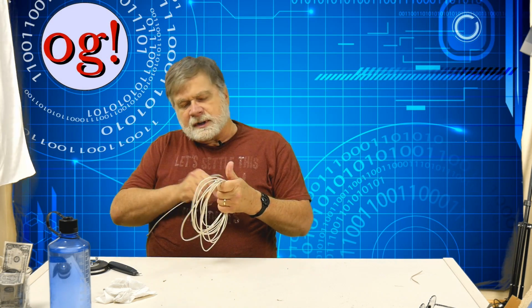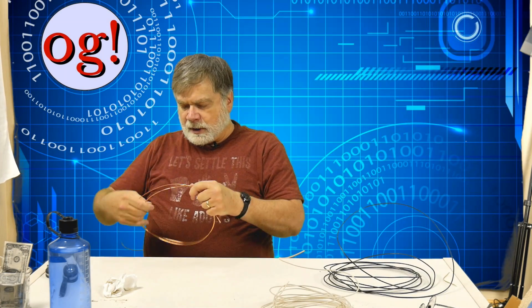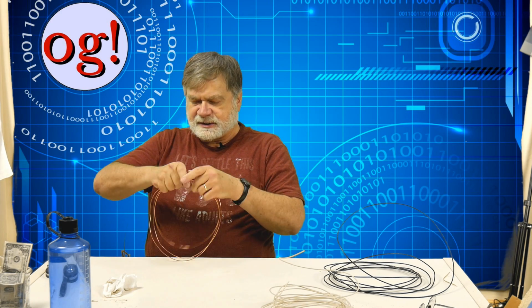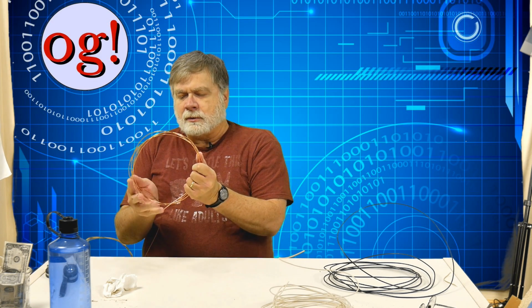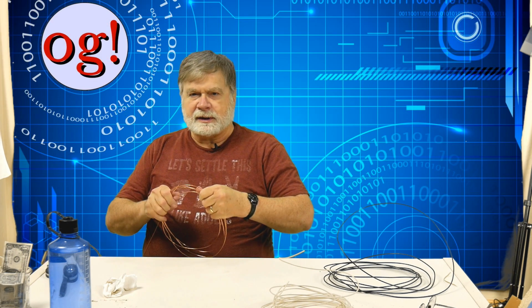Okay, so we're just going to run this into a nice little hank of wire. I don't mind working with 14 gauge wire. 12 gauge wire is just stiff. And besides which, 16 gauge wire would do really well here. And for a 100 watt rig, you could probably get by with even 18 gauge.